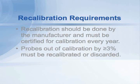What's the difference between checking and recalibration? Checking is something a user can do — and in fact must do — before using the probes. Recalibration is actually taking a probe to the manufacturer, having them check it in their factory, and providing a certificate traceable to a national standard, adjusting the probe if necessary. If you find that your probe is out of accuracy by more than 3%, the standard requires it be recalibrated or discarded. Recalibration is generally something users cannot do themselves.